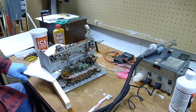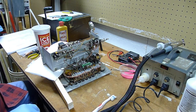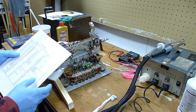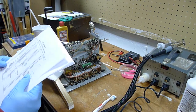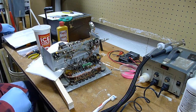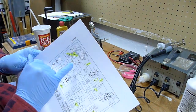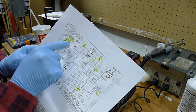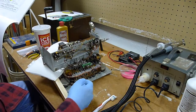Now, there's still one capacitor that is supposed to be a plus or minus 2%. And that was this 0.0115 microfarad 200 volt capacitor, which I believe is a mica capacitor, and I'm not going to replace it anyway. C3 coming off of the R1 rheostat and going to this button bar down here on the end.